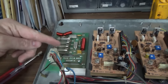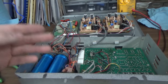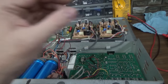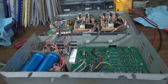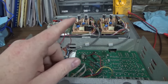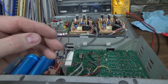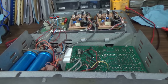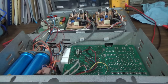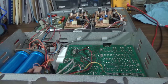What we're going to do is check the fuses first. I'm not going to power up any of this. The proper way to do it is to put it under load, to power it up, to test each component as you go through. I'm not skilled enough to do that, so the way I usually do it is I test the things that I can — I look for transistors that are shorted, and then I pretty much shotgun replace the capacitors. Because typically, an amplifier of this vintage is going to have a lot of bad caps.